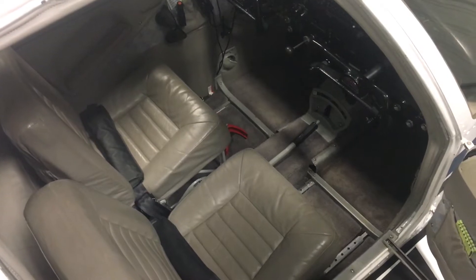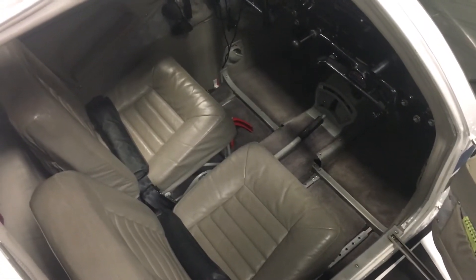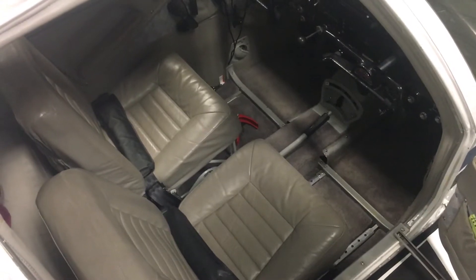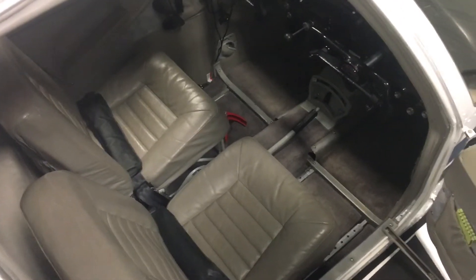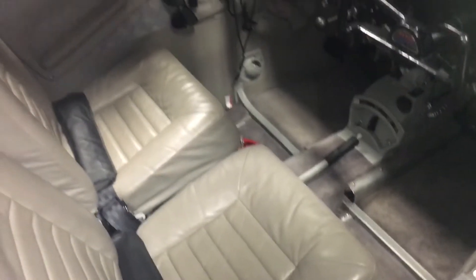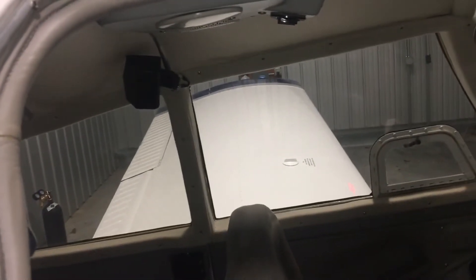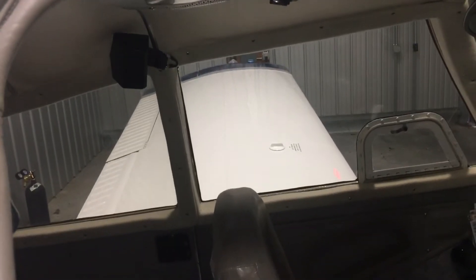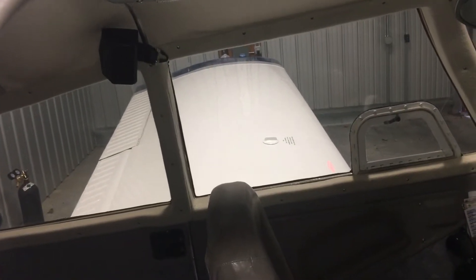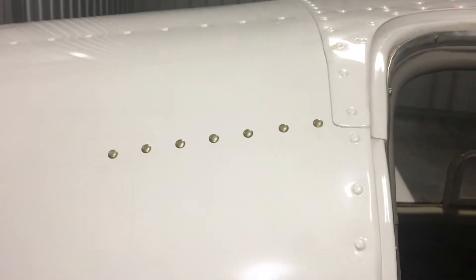Anything else you'd have to be very specific - even Garmin GPS units have an STC for every airplane they go in, but these you can just put in anything. This is a 1967 Cherokee; it didn't have shoulder harnesses either. Those reels do come with the kit, but installing them is separate. I went with the Alpha Aviation STC to install those, then used the Amsafe reels.